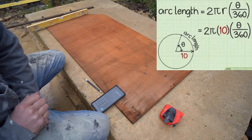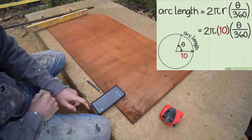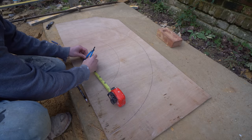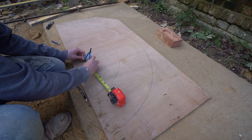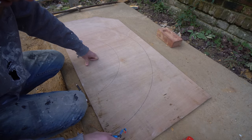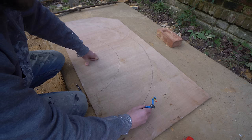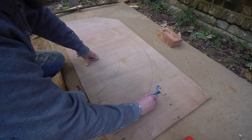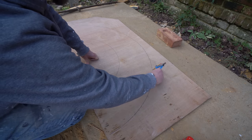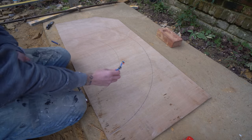So now all I'm going to do is quickly run around again at 73mm and mark those out. You mark at 73 millimetres and just run it straight the way around. I know that's a little bit finicky doing that maths, but that is the difference between a bricklayer and a trowel hand. If you are a trowel hand, basically all you're doing is laying straight — one brick on top of two. If you're a true bricklayer, you're able to use all sorts of equations and work out arches amongst a whole heap of other things. If you can say you're a bricklayer, you're a lot more skilled than people think you are.